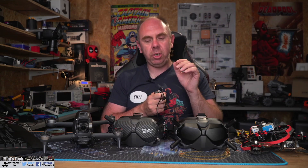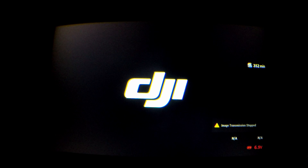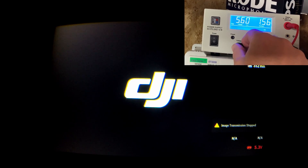Let's take a closer look at this low-power behavior itself. We have the V2 goggles in FPV air unit mode — you can see this from the on-screen display. We have them connected to a bench power supply and we're going to reduce the voltage down to approximately 5.2 to 5.15 volts. At that point you see the goggles reset, a blue screen appear, and the goggles enter this cycling behavior because there isn't enough power to keep them going. Rather than powering down and shutting off, they enter this cycling loop where the goggles show either a colored display, the DJI logo, lines on the screen, a broken-up screen — a total mess of an image on the display as it cycles time and time again.